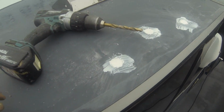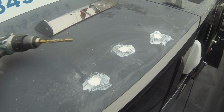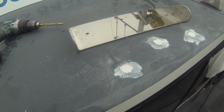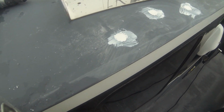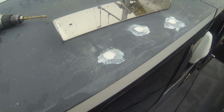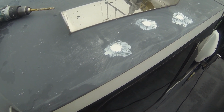So one thing about foam core composites is that if you're doing any through bolting, you need to support the compression strength of the bolt, because you can crush and pinch the skins of the core, and it becomes unsightly and things like that, and also there's no strength in the bolt then.